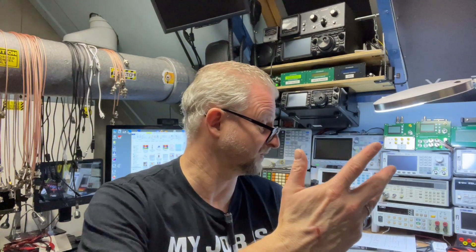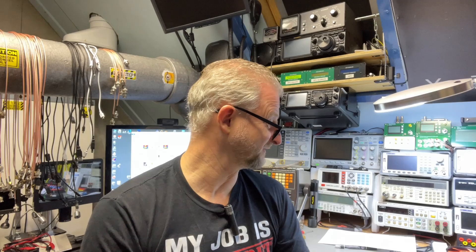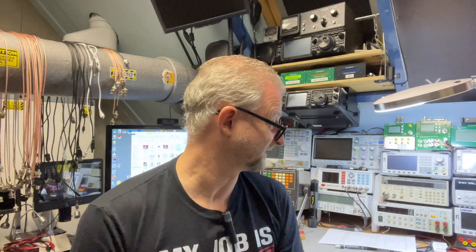Downloading and installing the app was really super easy. I connected it but the voltage display goes up to 300 or 600 volts, and I didn't find a way to zoom in on that — so we only see a few volts. For the amps it's the same — goes up to 20 amps, but we are discharging with one amp at 1.5V, so we're at the very bottom. I could change the time frame but not the voltage scale, so for our test right now the phone app is useless.